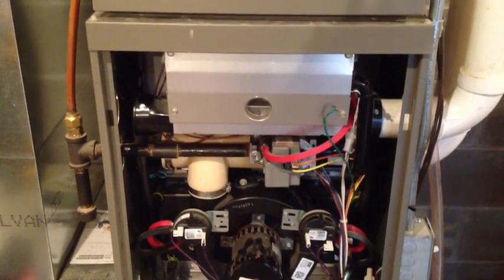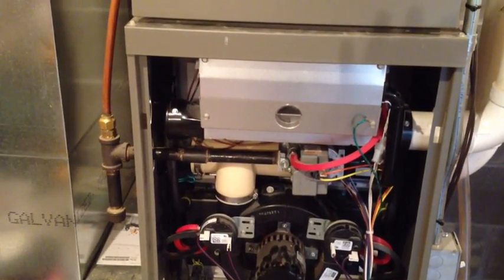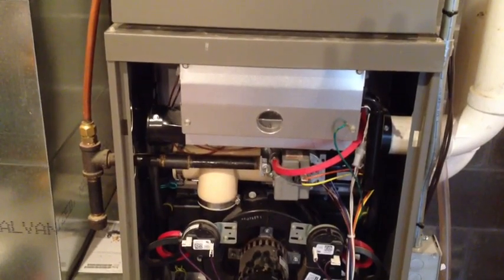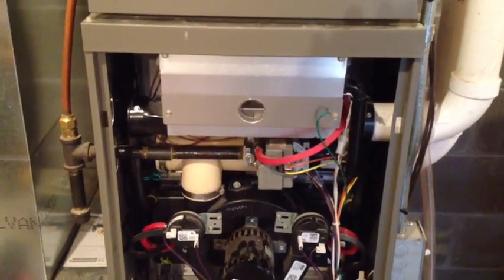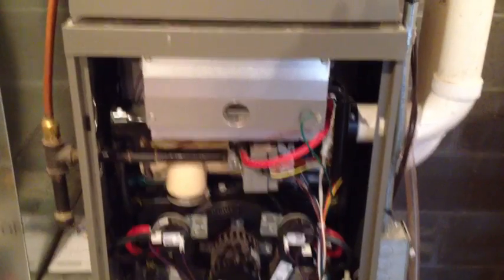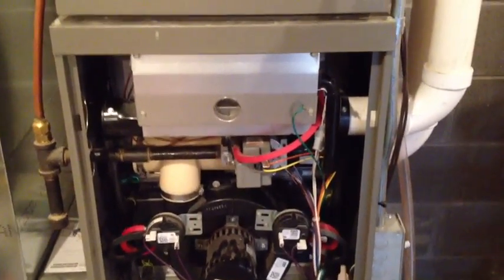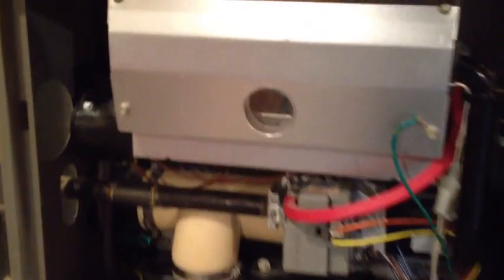It goes through to the pilot light, past the pilot light, it ignites, the flame comes out of the gas head, and then if the flame sensor doesn't pick up the change in temperature, doesn't recognize that this thing's getting beat up with flames, then it sends a message back to the gas valve, which shuts it down. So that's an obvious possibility with the scenario we're looking at. Alright, so the flame sensor we're going to find inside this little viewing window.